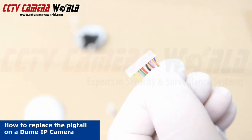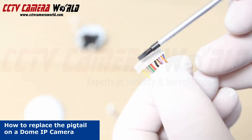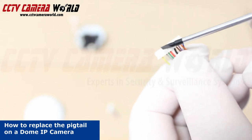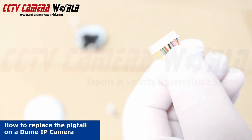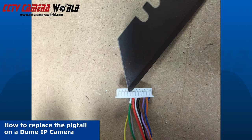At this point you'll have to remove each and every one of the wires by raising this lever here and removing the pin. There's a notch inside holding each of them in place, and you have to be careful to do this one at a time. There's no specialized tool for this — we choose to use a razor. Here is the pinout of the pigtail's 10-pin connector. This is the technique we used to raise the locking lever in order to remove the pins one at a time.